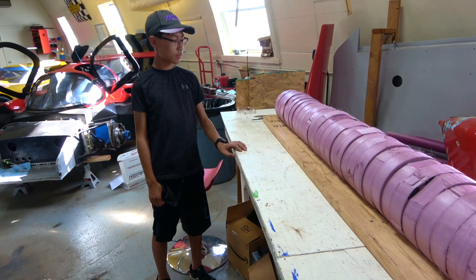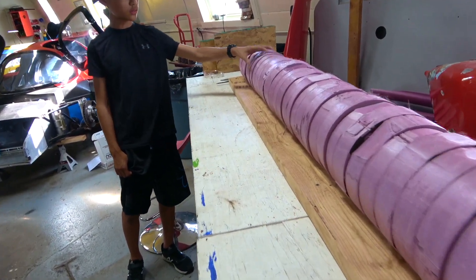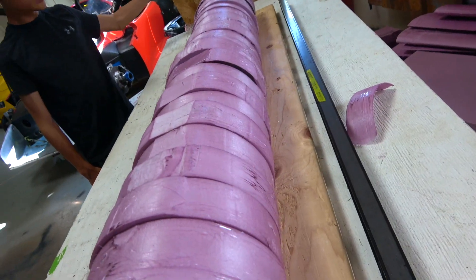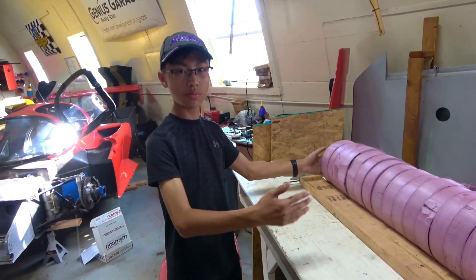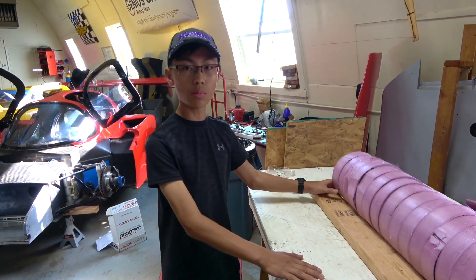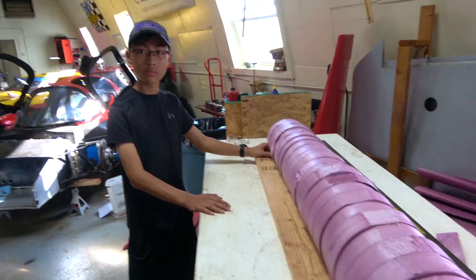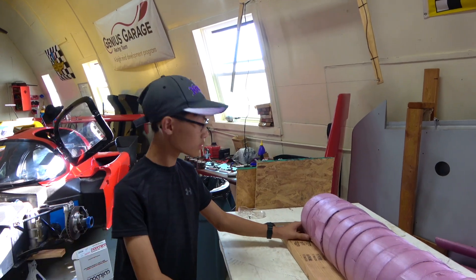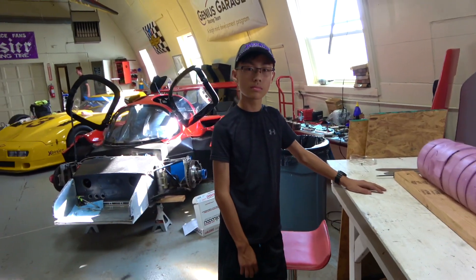Okay, so what's this contraption and how does it work? Basically we have this wood that holds these circles in place — two by fours here, one here and one over there. We use these pieces of wood on the end with ratchet straps so they put tension and hold everything together. So this wood keeps everything straight, and you ratchet it so when you glue this it holds tight. Yep.